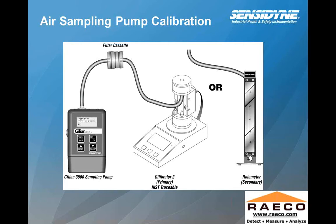Air sampling pump calibration: your calibrator always goes on the end of the sampling train. You're hooking up your air sampling pump through your filter cassette, then calibrating. Say you're setting the pump at 3,500 cc's (3.5 liters a minute), but the calibrator shows it's actually at 3.1 liters a minute. Now you'll have to make an adjustment on your pump to match the calibrator. When you hit enter, the pump will actually speed up to get to the desired flow rate of 3,500 cc's — then you double-check and confirm it's up to 3.5 liters a minute.